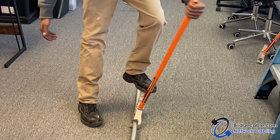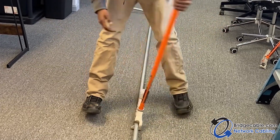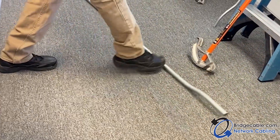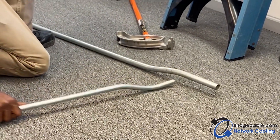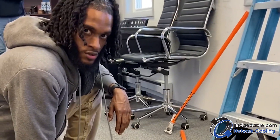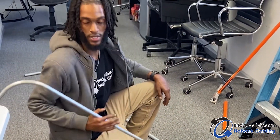Bring the other side level with the front so you just have that dip. Once you go back down — beautiful. When you're coming down the wall and the pipe needs to go under something, that offset puts it right under the obstacle and lets you keep the run going over the pipe and continue through the wall. That's how you do an offset.